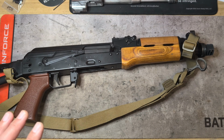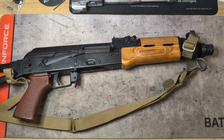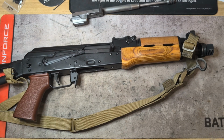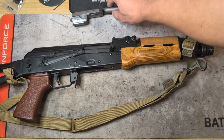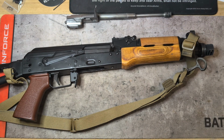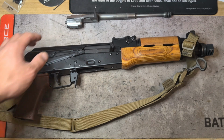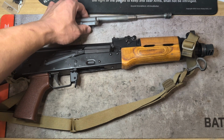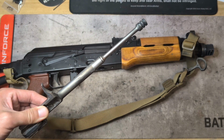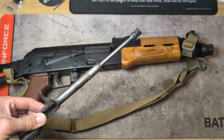Wanted a blackened one, so happened to be perusing around on AR15.com in the AK-47 discussion forum, and I saw a post where somebody asked about blackening one of these things, and some people were offering some suggestions, and then somebody had linked in that Atlantic Firearms was selling these WBP 5.56 carriers for $75. So a couple different benefits that I thought from there. Besides getting the blackened color that I wanted, I also knew that from my experience with other AKs that I wanted to get a KNS adjustable piston for it.